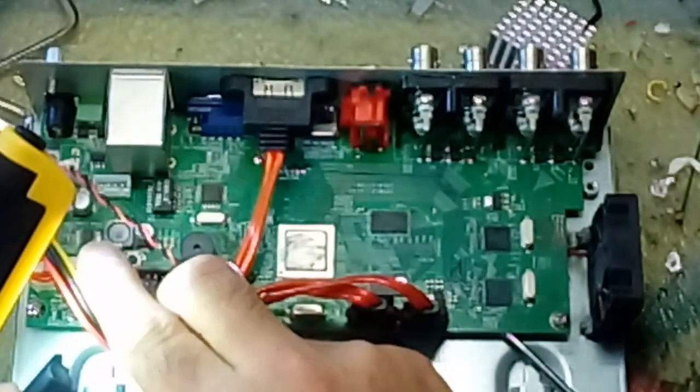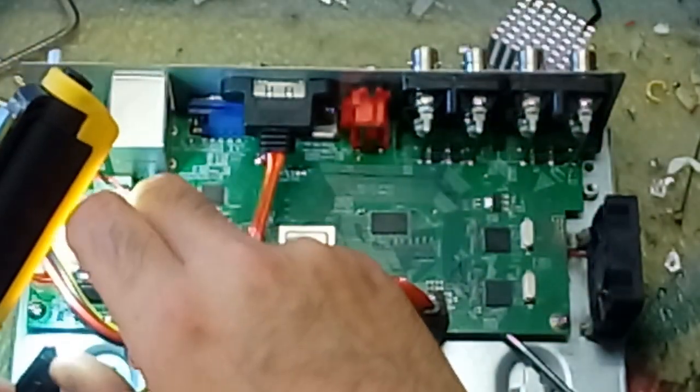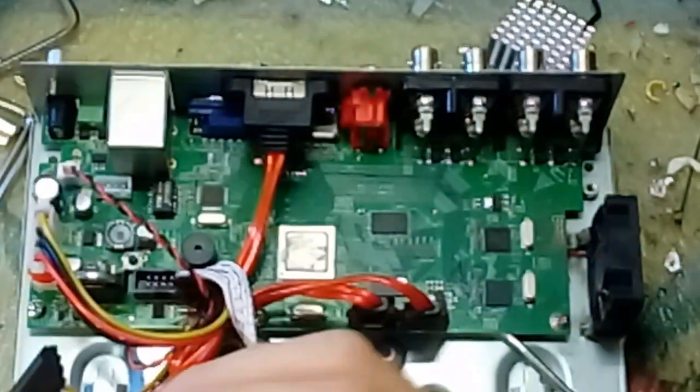Something that looks like an EEPROM chip down there. Using the torch to light it up — it's a HYM1307Z, so I'm not sure what it's doing off the top of my head. There are some small switch-mode voltage regulators down there. A clock crystal is right next to a clock chip of some sort, which is also right next to the clock battery — as if that wouldn't give it away. There's another 8-pin chip down here, possibly part of that circuit. These days we've managed to condense all that old hardware down to this one board, and it does a whole lot more.